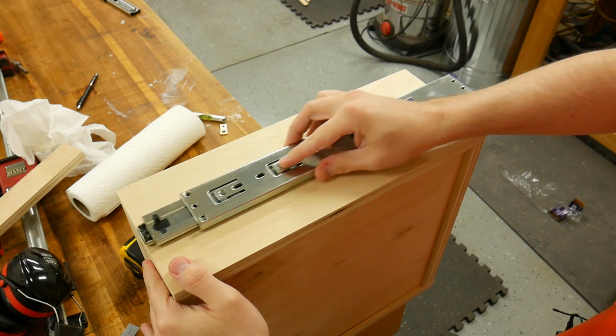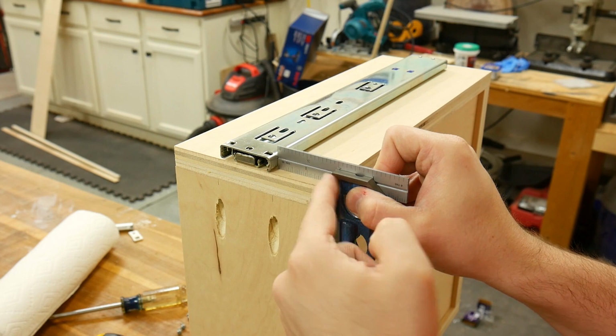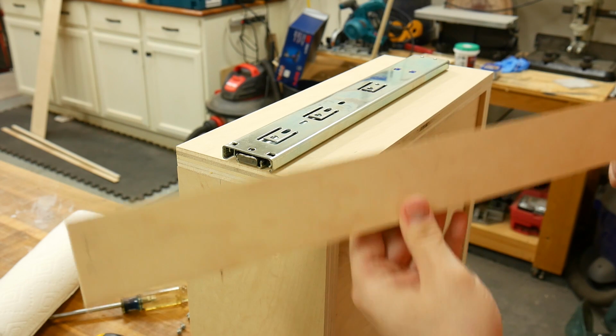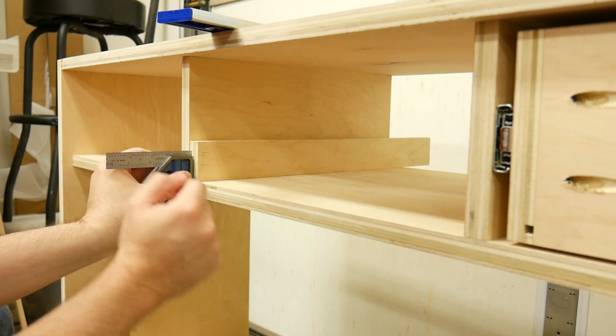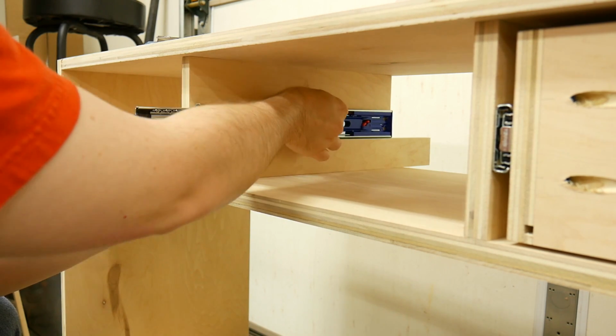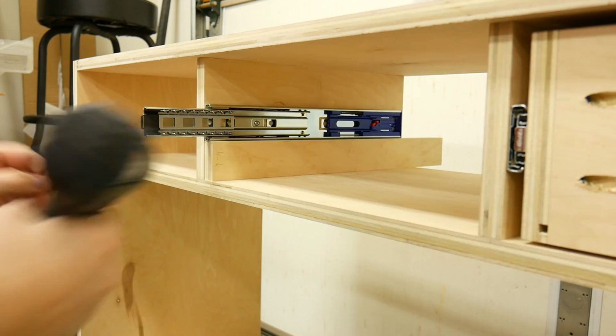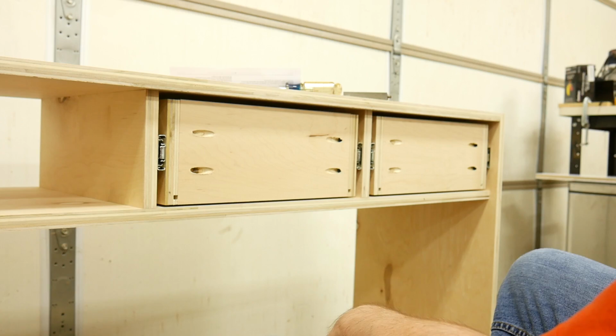With the drawer slides reinstalled, I use an 1/8 inch shim under my combination square to measure for a template that I can use for repeatability. The measurement of the combination square is the width of the template. The template is set back a 1/16 of an inch from the edge. The drawer slide sets on top of the template while I install the 3 screws. For this project, I installed 14 inch soft close drawer slides.